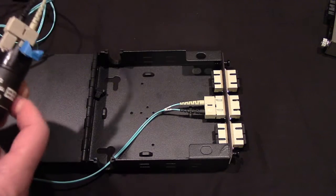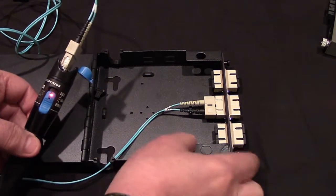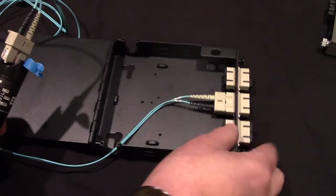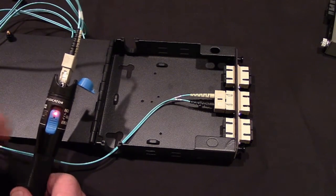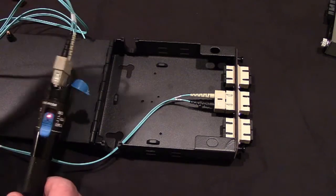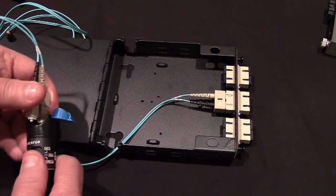You plug it into the laser tester, and the laser tester has a pulsing indicator here. And if we take a look, we can see the pulsing light right there. So, and we shouldn't look at that very long. We should honestly not be looking directly at those lasers for an extended period. But that's not going to bother your eyes just to take a look. But now you know which one that is. The one on this side is that one. So it's one of the ways to use the laser tester when you're testing fibers.